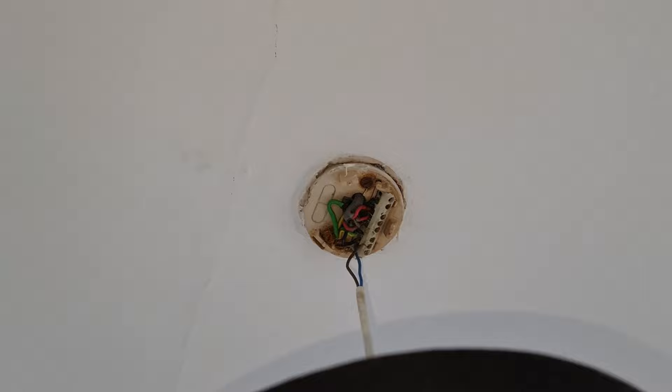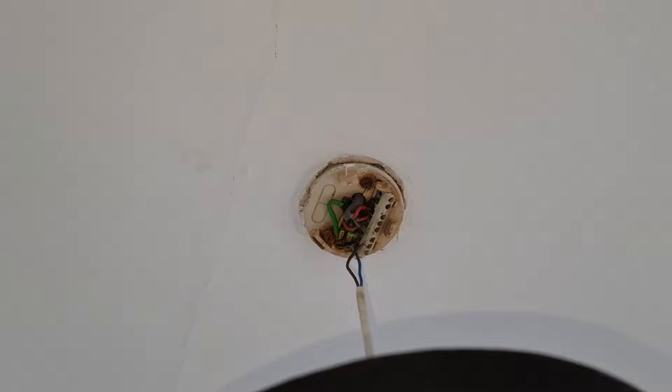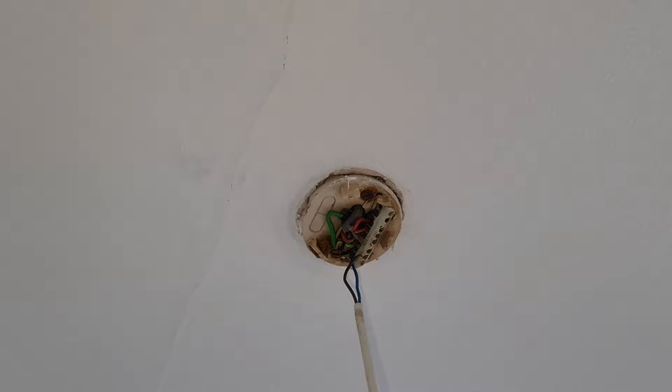There's something going on within this wider system. This is the light fitting in the bedroom outside the flat roof - the one which had basic insulation on show earlier. If you look, there is a very corroded CPC terminal on there, and that is going to cause us an issue with our impedance values - our R1/R2 measurements on this circuit. End of line is in the bathroom. I've taken a measurement in there as well and it's measuring over 4 ohms. It's still probably going to comply with the maximum ZS value for that B6 overcurrent protection, but we know those continuity values are nowhere near right for a 1mm twin-and-earth cable running around this very short circuit.